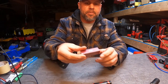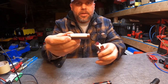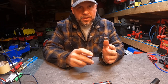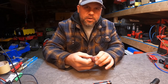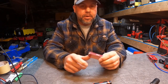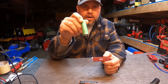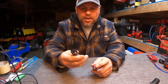These little Red Lithium USB battery packs can be upgraded. I really like to use the LG HG2 cell — 3000 milliamp, 20 amp discharge. These are really good cells for my climate — the cold weather climate. Everyone wants to know what's the very best 18650 battery cell, and there's no good answer for that. All the cells have kind of a different purpose — what's your situation, what are you using it in? Maybe if I was in a warmer climate like Florida, the Samsung 30Q is probably what I would want to upgrade these to. But the LG HG2s are what works good for me. They might not work best for everybody, but these are good cells and they're about $6. So for $6, we fixed a $20 battery. If you just wanted to replace it with the original Samsung 25R, you can pick those up for about $3 a cell, but if you're going to cut it open and do all that work, just go ahead and upgrade it for a few more dollars to the 3.0.